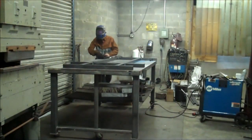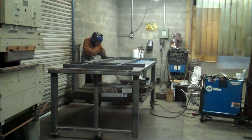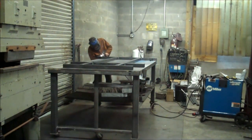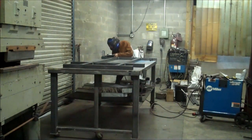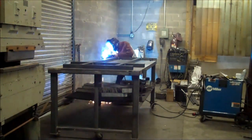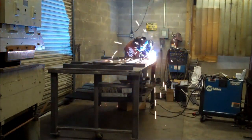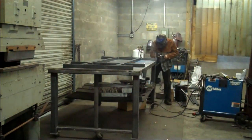Thanks for the introduction. For the bicycle frame, there are many processes to complete the fabrication. We start by buying 2-inch steel tubing in bulk from a local supplier. Once the material is received, the tubing is cut to size per specs on the drawing. Each piece of tubing has a different process that it may go through. Each individual piece has different hole locations for different mounting purposes. This is done on our CNC machine. Once all the tubing has been machined and holes are added, it moves to the welding process. Each component is placed in its proper location, which will help with making multiple bikes. Once the fabrication of the frame is complete, they're sent off to powder coat.